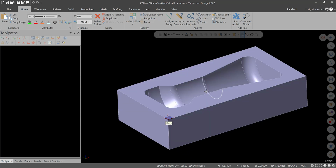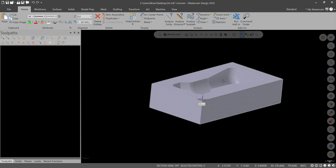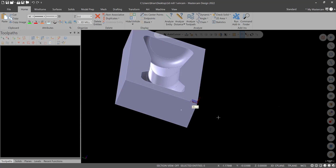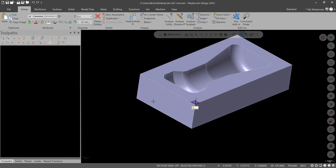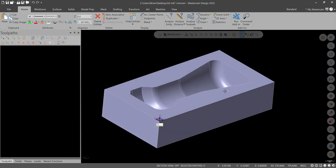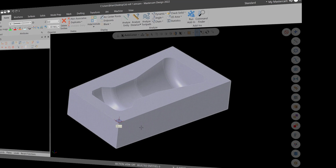Because it depends on what stock we're going to work with in the shop, whether I assign it to be aluminum or steel, you'll have to adjust speeds and feeds accordingly. So we'll just grab this in a vise from here to here. And then we'll start facing, maybe chamfer the outside, and then start 3D milling. So this is the assignment. Download the model, and we'll transition here, and I'll catch up with merging the vise and all that stuff.